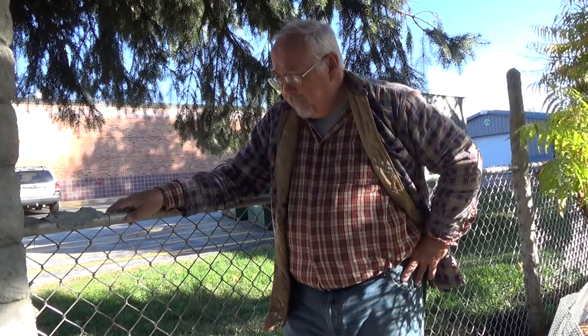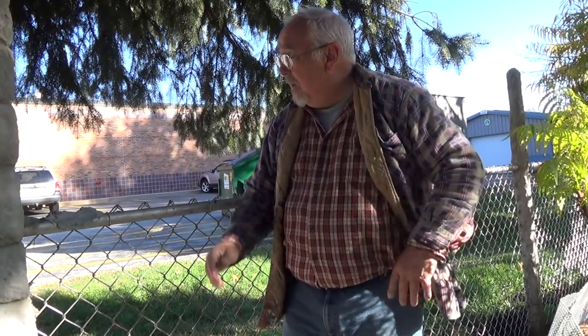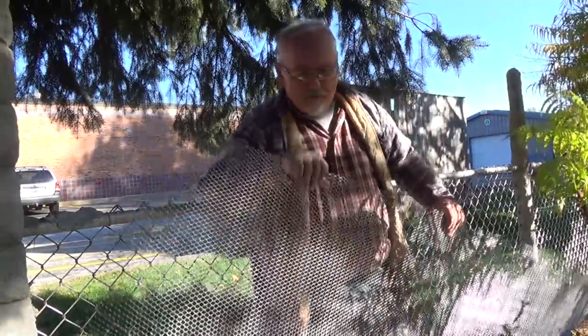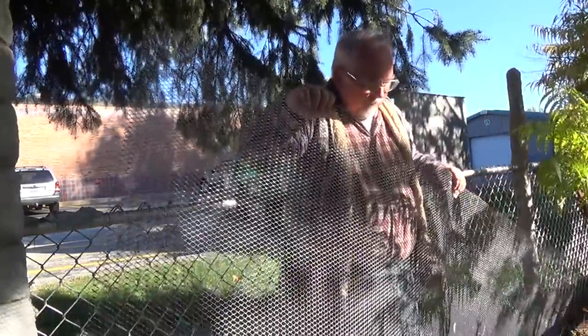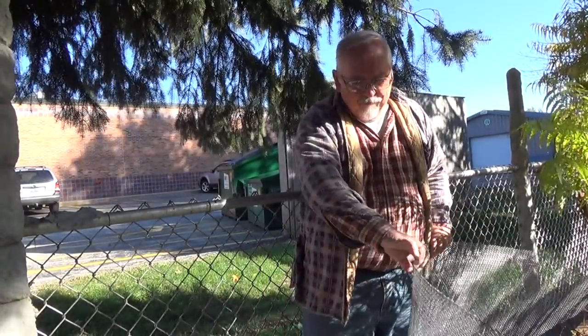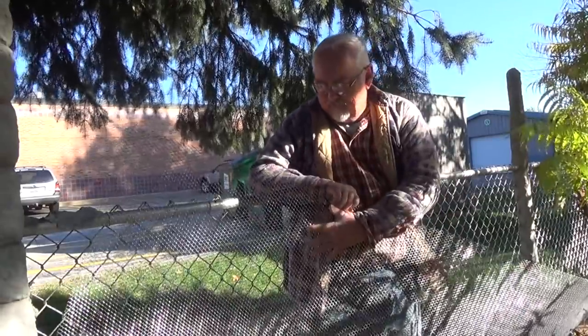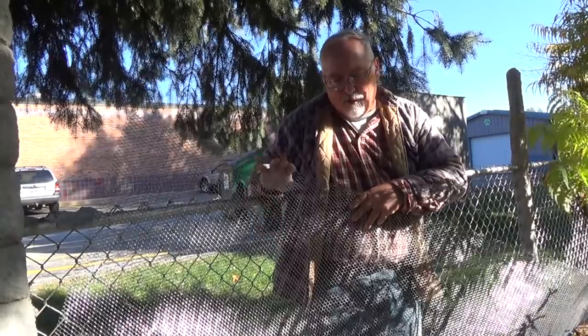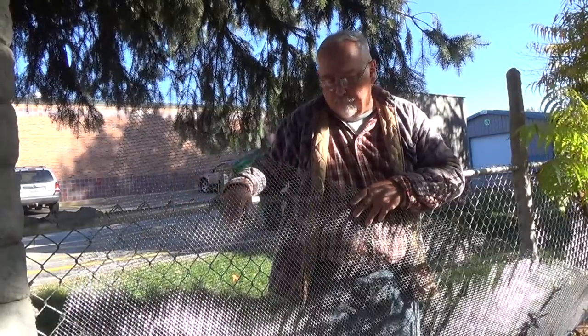After using chicken wire and fiberglass mesh, I found that the best thing for me to do to fill in the field of the fence is to use the expanded metal lath. So that's what I'm going to do here, attach the metal lath to the inside of the chain link fence. Then we'll fill this side with concrete. It'll ooze through, make a good solid base for concrete to be put on from the outside as well.